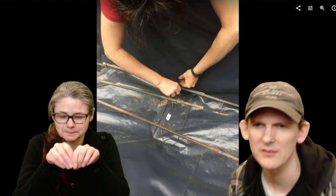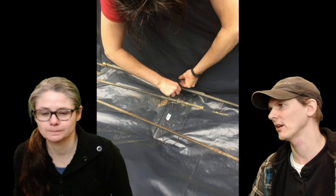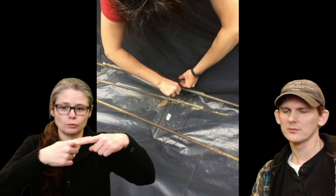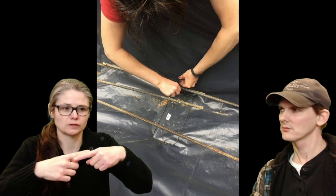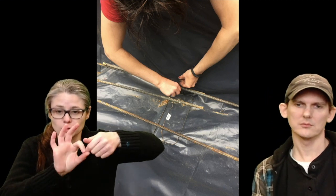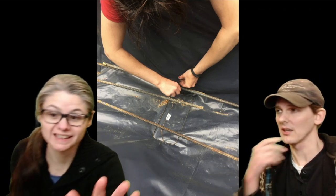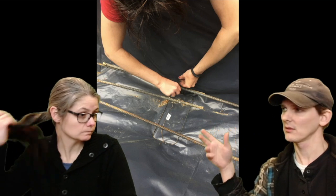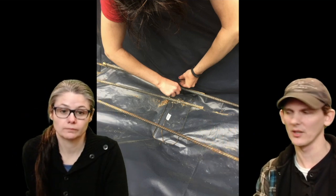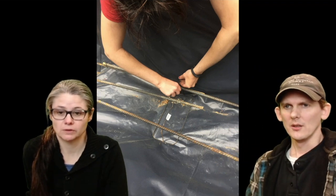So rebar. Linda's doing these little ties. You can get these ties, this rebar, this poly, all this stuff at Lowe's. It's attaching two rebars together with these little metal tie wraps, wrapping around and twisting every so many inches. This obviously didn't come with the kit. The kit was just the building, and we went to Lowe's to pick up all this other stuff. But I think any big box store or lumberyard is going to have this type of stuff. It wasn't hard to get.